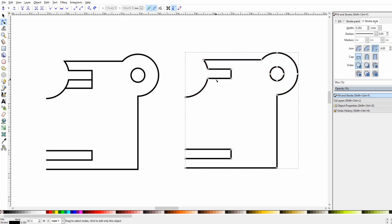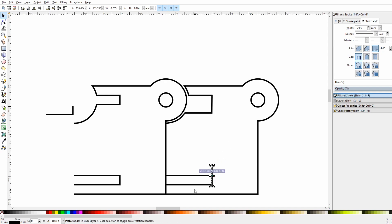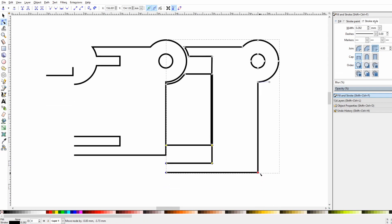The next thing you need to consider is that the material thickness you're going to be cutting with your laser cutter matches the notches so that they can actually slide together. The original drawing I took my dimensions from was meant for 2 millimeter ply whereas I was using 3.8mm, so I changed it to 3.8 and found it was a loose fit. You need to subtract the thickness of your laser beam's kerf — I ended up making my notches 3.2 millimeters for my 3.8 millimeter ply.